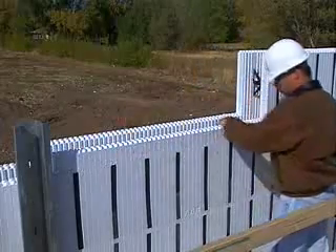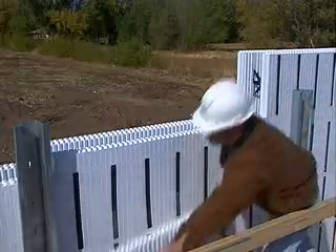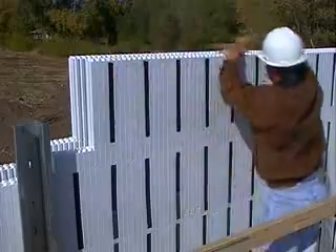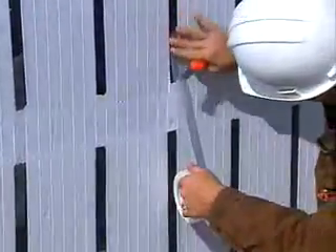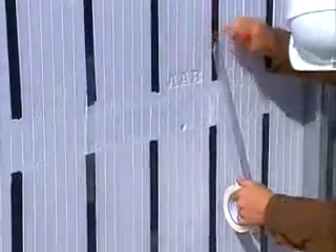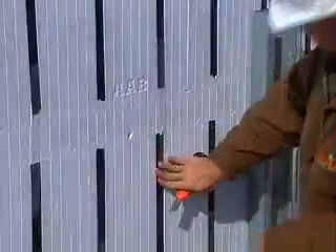Height adjusters are sandwiched between two conventional courses to increment the wall height 3 and 3/8 inches. When using height adjusters, place vertical strips of fiberglass tape 16 inches on center at the webs to provide a vertical tie.